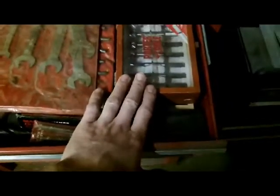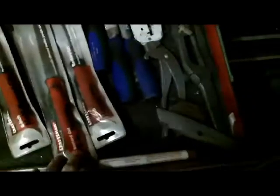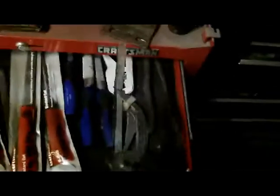We have drill bits, more drill bits, spade bits. Those are tools for router. Forstner bits for drilling a blind square hole instead of using these. These will drill it, especially if you're putting like dowel plugs in to hide a screw or something when you're doing woodwork. I don't do a lot of woodwork, but I bought those when I was doing work on my boat. Alright. Files, little keyhole files, bastard files, mill files. Those are wood rasps. Little, I don't know that you want to call this a pocket hacksaw, but that's kind of handy for cutting small things.